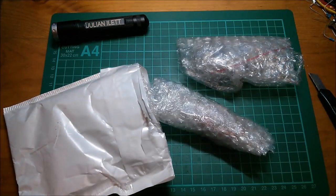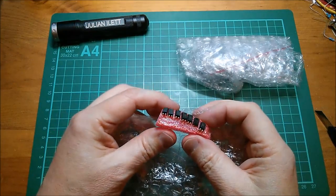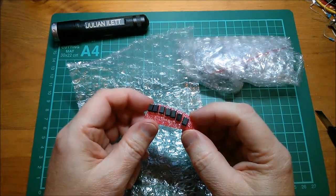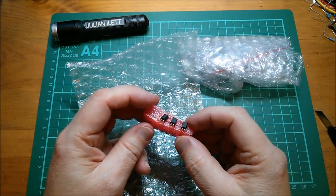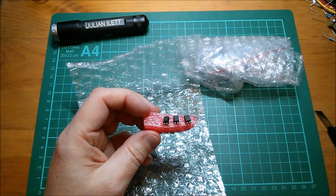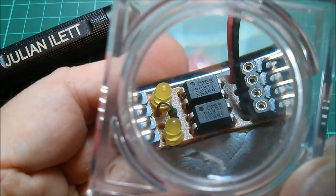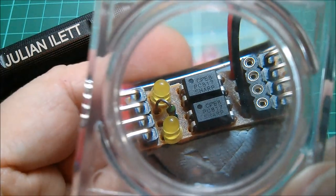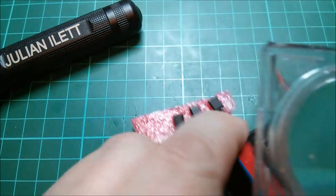Okay, two things wrapped up in bubble wrap. These are opto isolators - whenever you see dual in-line packages that only have four pins, apart from bridge rectifiers, these pretty much have to be optos. In the past I've always bought these opto isolators - these are Sharp PC817s, and I've also bought EL817s, but they're essentially the same.